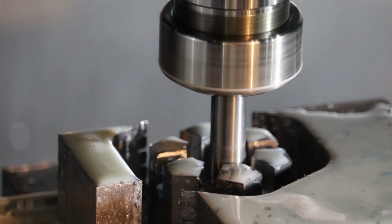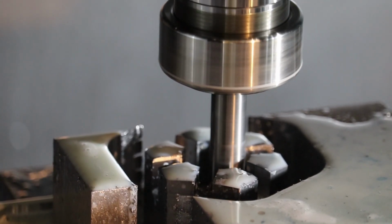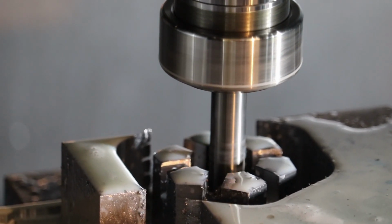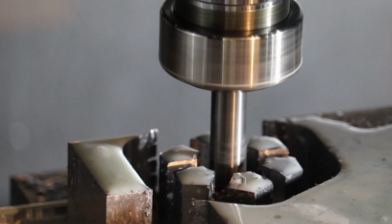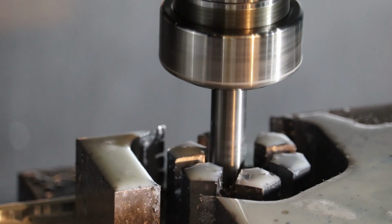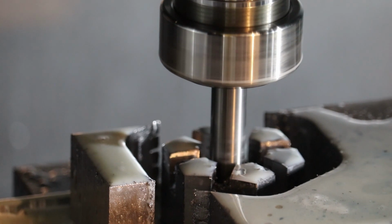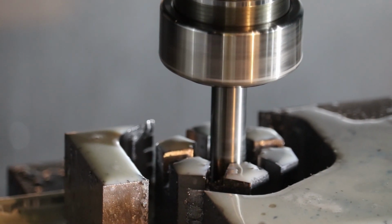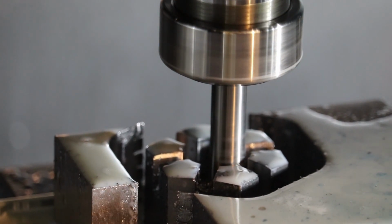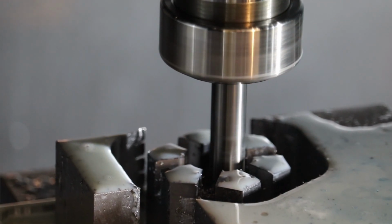So after we finish this cut, I'm going to try out the actual shaft or the mating thread, and it's almost certainly going to be too tight because I didn't add any thread slop into this profile yet. That'll be the next step, is we'll start encroaching on the ideal thread size to create the clearance. Usually it's like a 2A or a 2B clearance on typical threads. Now that's just so you can screw the thread in without it jamming up and basically cold welding. We're starting to hit the interrupted cut from the castle wall.